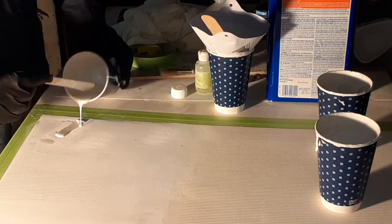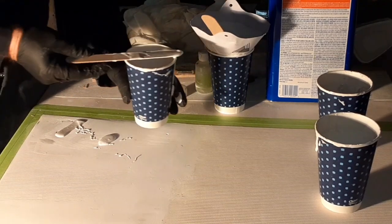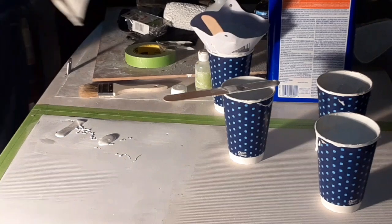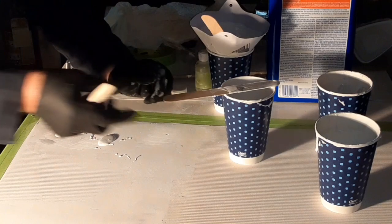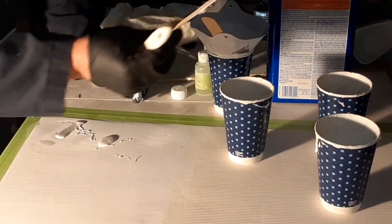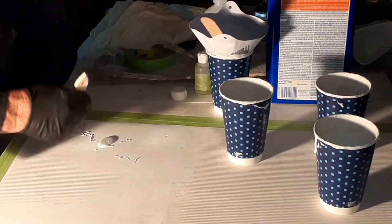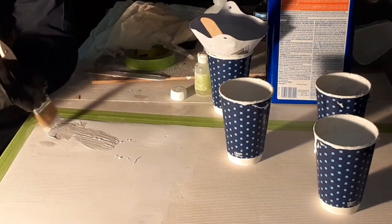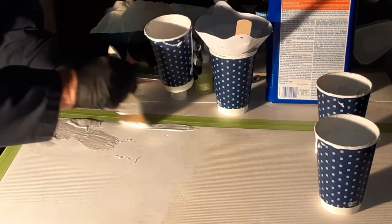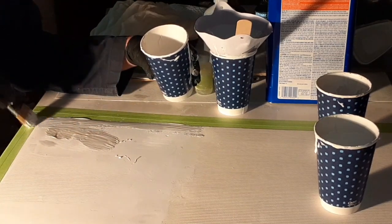Now, this is a small hole — I don't know if a tree limb fell on this or what it was, but I had repaired a small hole here and brought the fiberglass up to level. What I'm going to do is pour it pretty thick with gel coat to fill that small dimple. Then I will take the china bristle brush and smooth that out, actually leveling that area. Gel coat can be fairly thick — it's just like epoxy, it has some strength to it. I'm just going to brush this on and get everything leveled off.